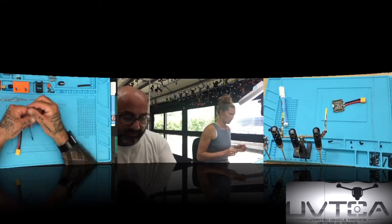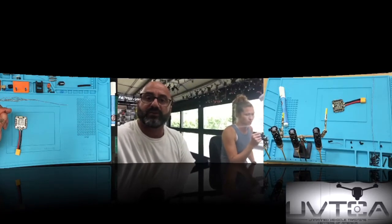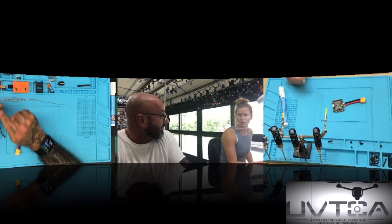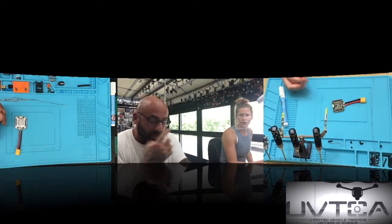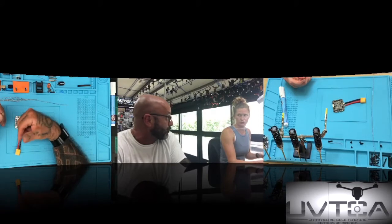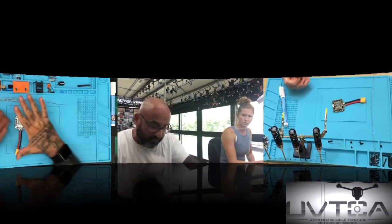Now, if you look at this wire right here, you're going to see it's already tinned. Oh, you notice? Sweet. No, that's not sweet. The tinning that they use, I told you the factory tin, is a higher temperature. There's no way you're going to get that to melt at what we've got our iron set to. It's impossible, so it'll take too long. You'll burn your hand or the cable first. So we're going to tin this wire. Even though it's tinned, we're going to add more solder, because our solder on here will heat up their solder and cause everything to sink in together.